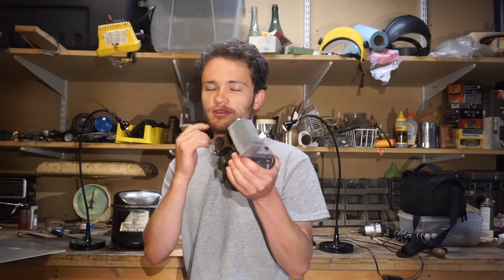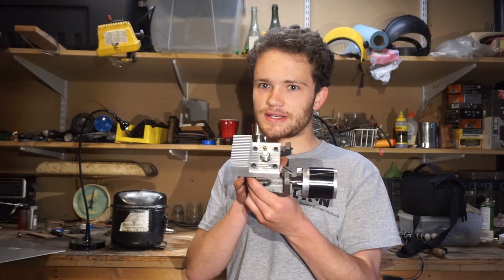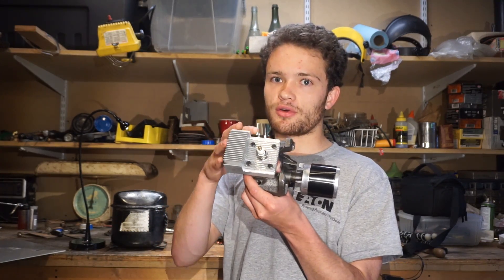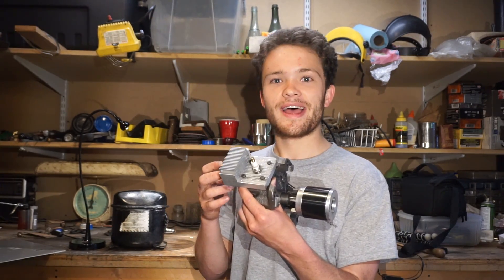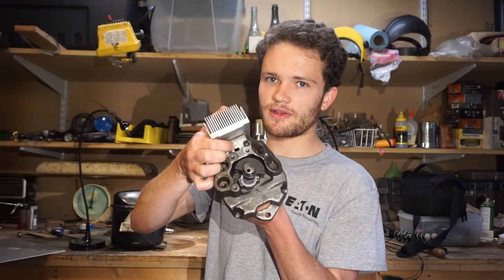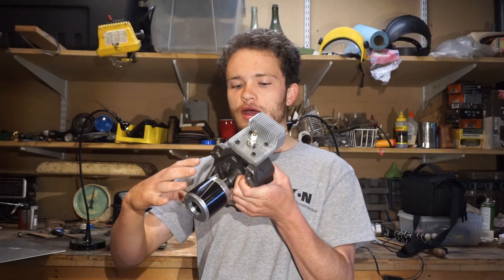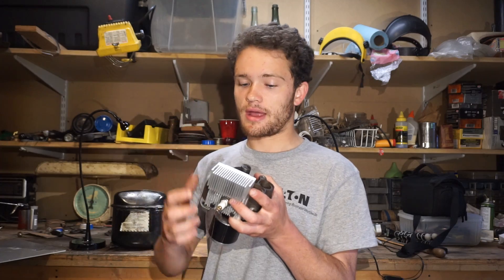This is the progress so far. As you remember from part three, we manufactured this pretty rad head out of an old Intel heatsink — we cut it up, drilled a couple holes in it, and tapped the spark plug right into it by threading it in. Some of you were speculating in the comments that it might fly out because it's not threaded in very well. In part two we put the ports in, so we have an intake port and an exhaust port — just two holes in the cylinder — to allow fuel-air mixture to enter and exhaust.